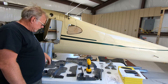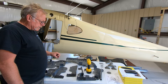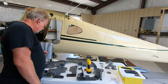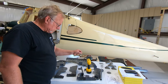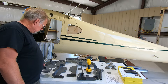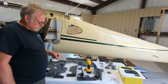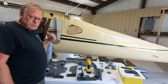We took one side off and it looks pretty good. So I'm going to slowly fit these parts up and run the camera and talk over it. Everything's looking pretty good but we are going to have to do a little work on probably half these parts — a little grind or two. Just little bits, because while these parts are just fabulous and they made them just like Cessna did, because of the variability of the engine parts we're going to have to just do a couple little clearance reliefs to make sure we have an air gap and we're not metal on metal. That's where we are right now — off to putting baffles in, one at a time.